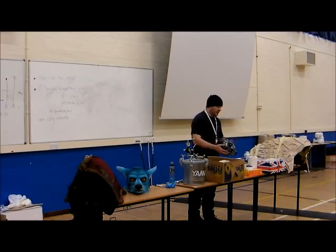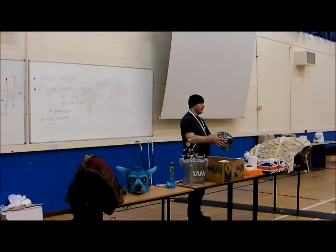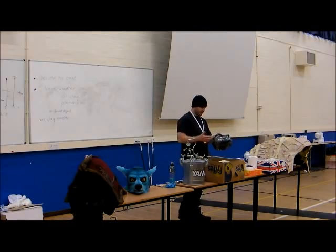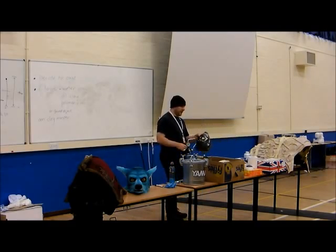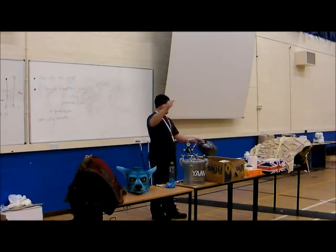So one piece mould all over, one piece covered it all in silicone. Two-part mother mould, bump, bump, like that. I actually did a supporting mould on this as well, so basically like this little C shape that holds the two mould pieces together. I was just being a clever little smart ass. But basically, because the silicone, that particular type of silicone, is Platsil Gel 10 I used for the mould for this, it's a lot more expensive than that stuff. The mould for this probably cost about 60 quid to make, because I'm an idiot. I was just able to just go and just pull it off like it was a skin.